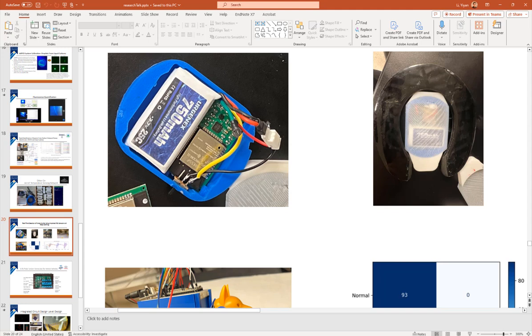Okay, so this little thing has an ESP32, a 2-core CPU, 32 bits, and with Wi-Fi wireless capability on that. So eventually this is a little accelerometer. You can see how small that is, and that's the LDO. So the LDO has to be tiny as well. We found the LDO, like $5 a piece from TI, soldered on it, and you can see all the resistors are 0603 instead of the 1206 surface mount that we use for our PIC board. So that's why I'm telling you guys the 1206 are huge, even though they are surface mount components. But compared to the 0603 ones, these are the smallest ones I can solder by hand.